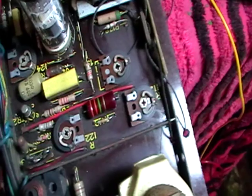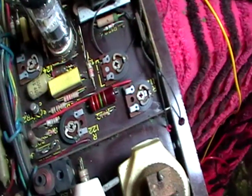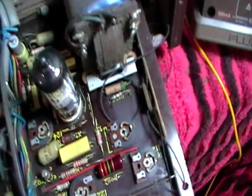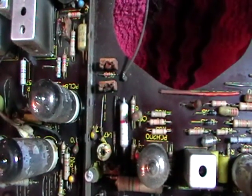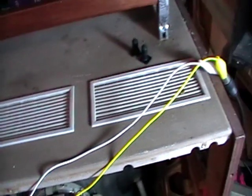I've installed the new 3.3 meg resistor - the one I've put in is overkill for the circuit, it's about a two or three watt one. I've got heaps of these RS resistors, new old stock, about a dozen of them, so I've put it in there - at least it'll prove a point. And you'll love my quality 300 ohm to 75 ohm balun here - a couple of crocodile clips running into an RF lead. I've got a lead somewhere but just can't find it, so this is a temporary solution.